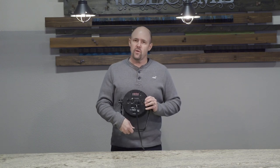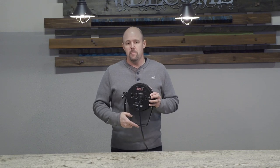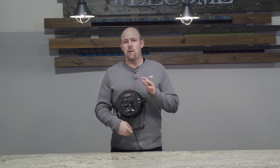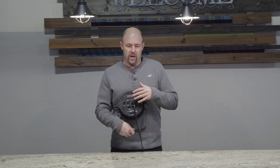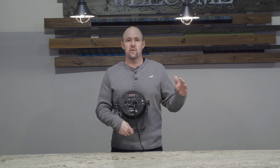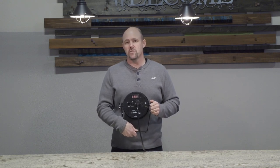If you're controlling your lights with either a light board or an app, you really want to put your lights in the lowest number — using the fewest channels possible. In this case, we want to use six. The other features like strobing and different color effects are nice, but they're primarily designed for DJs. You want to think about whether to use the six- versus the 12-channel mode. The advantage of using the six-channel mode is that it takes up less of your DMX universe. With only 512 addresses in that space, by only using six channels, you'll get much better use of your space and fill up your universe a lot more slowly.